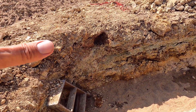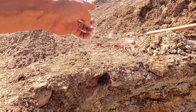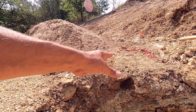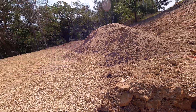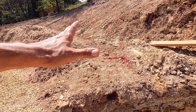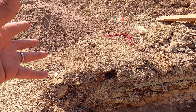Where it pops up into the shed, it's going to have a hydrant and it's going to run into a drain. So when I close off the hydrant, the water drains down into here, and any other water runs into the drain, which is going to run to daylight that way. The cabinet that it pops up into inside the shop — I'll be able to keep that heated. It shouldn't need it at all, but I'm going to do it anyway.